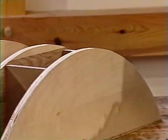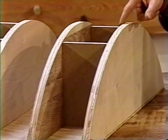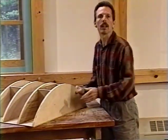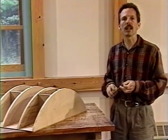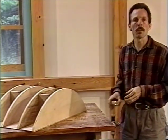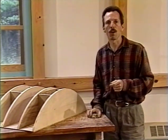The other important point is lateral end bracing like these you see here. This step is often overlooked, which results in the end ribs blowing inward. As a rule, this bracing is only necessary if the end ribs are more than 6 inches tall. The accumulated force vacuum applies is usually not a problem on lower profile forms.